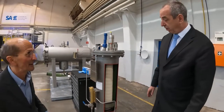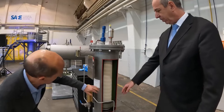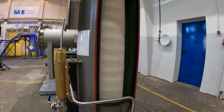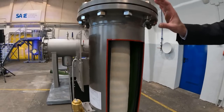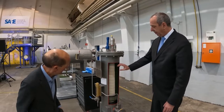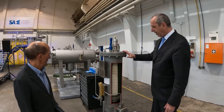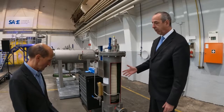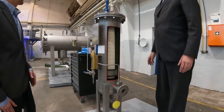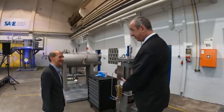There's an old Gammon gauge there. We've got Gammon here — good news, well done Jim. And this has got the separator element at the bottom, built-in. What we do here is we have reversed the separator flow — here the separator flow is from the in to the out. This is how we are able to achieve that small size and small setup. With that we can use standardized coalescers. It is not very well known at big airports but at smaller airports it's quite available. We have a drain point down there and pressure relief at the top — everything is there.